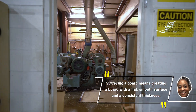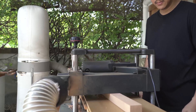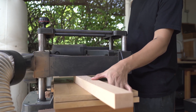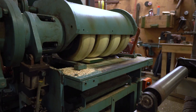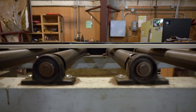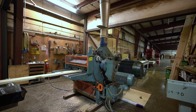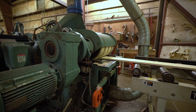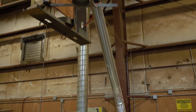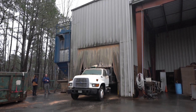And then we go through the planer. Now this planer is a beast — this thing is huge. Normally in our houses we have like a 13-inch planer, which basically planes the top side of the wood one side at a time. But this one is special: a 24-inch double-sided helical planer that planes both sides at the same time. That turns into sawdust — it goes up those pipes, and there's about three to four truckloads of sawdust that leave this place every day.